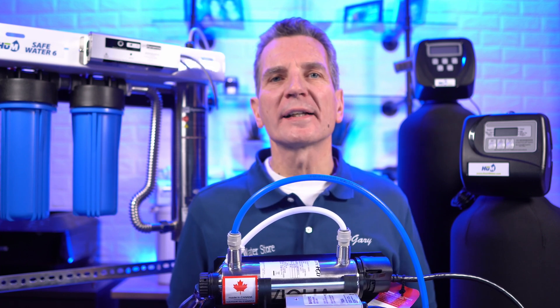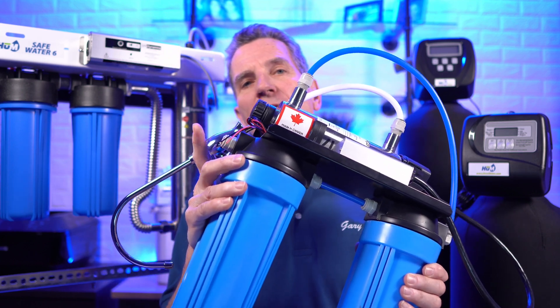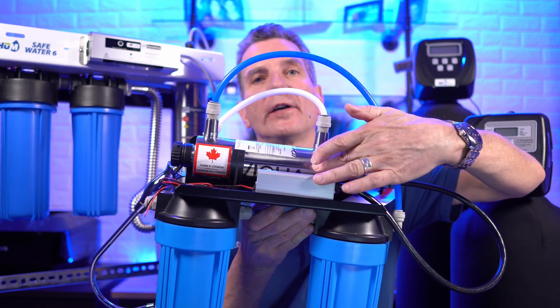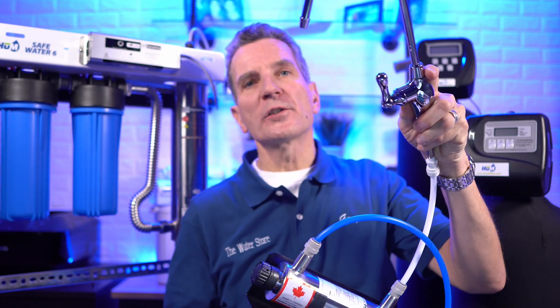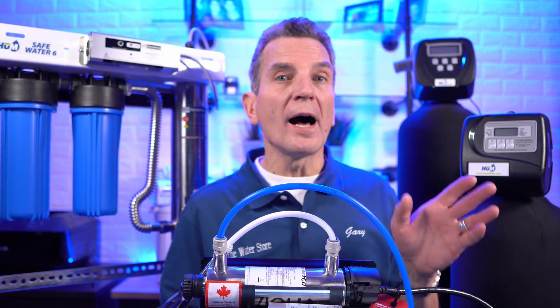First off, you'll probably be looking for something to make sure the water is bacteria free and safe for your family to drink. So you can start with something like this — the VT1 DWS. The water flows in through this side, goes through the sediment filter first, then to the carbon filter, then over to the ultraviolet light that kills the bacteria, and then comes out to this one single faucet. It's a great system available in 12 volt — this one actually has the 12 volt ballast — but it's also available in 110 volt and in a couple of different sizes with larger filters for more capacity. It's also available as a VT4 for a higher flow rate. That system is super easy to winterize: just unscrew the filter housings, dump out the water, pull out the glass sleeve and the UV lamp, drain the whole system down, and unplug it. It's available 12 volt for folks on solar and 110 volt for those who aren't.